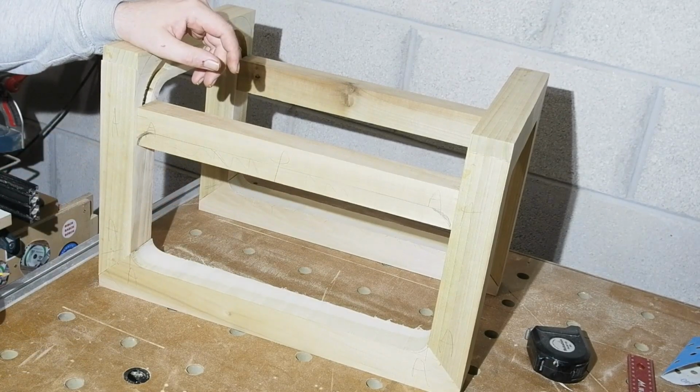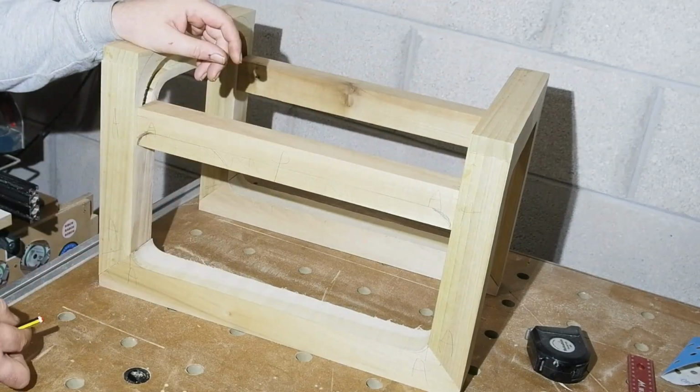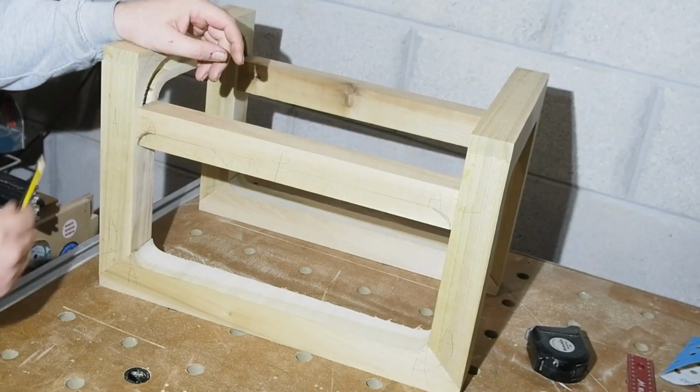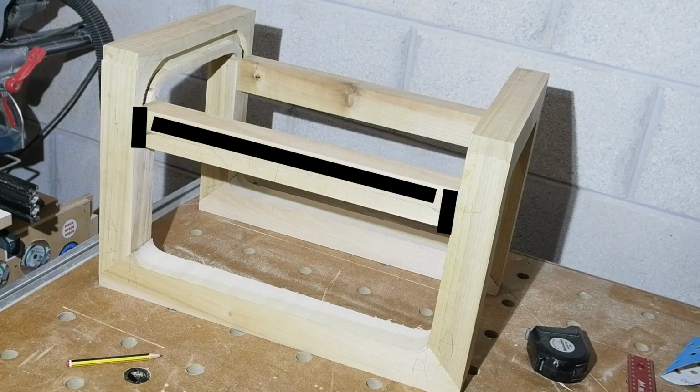While I'm at this point, I would say that this isn't the way you'd normally go about creating a blend like this. I'm only doing it this way as it was an afterthought. Normally, and how this will be done in the future, you'd have stock on the receiving or female piece, the leg in this instance, a kind of outcropping. Then you butt a straight piece into it. This will give you a fine, straight glue line at the join.